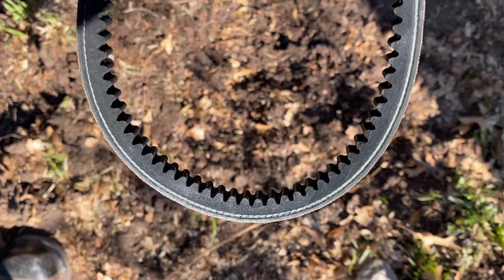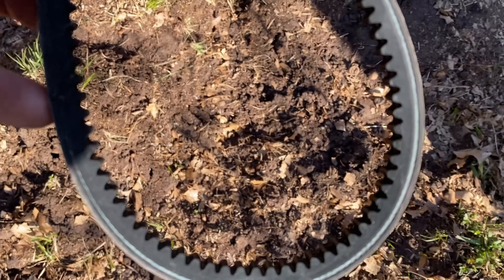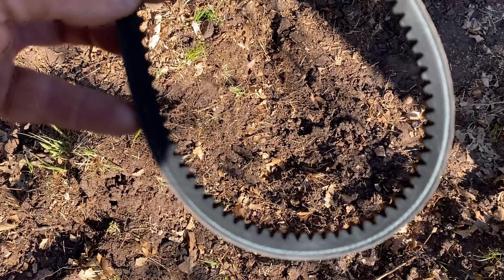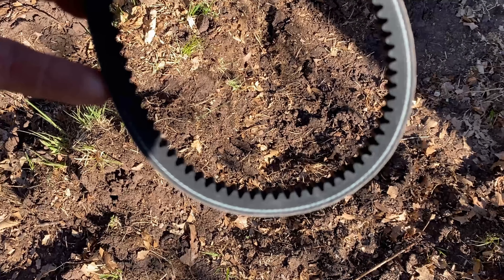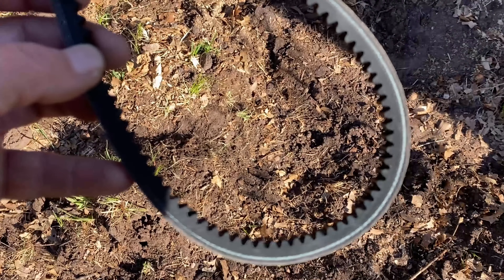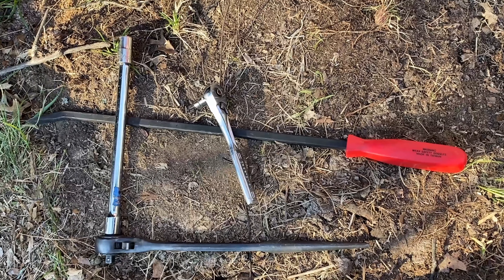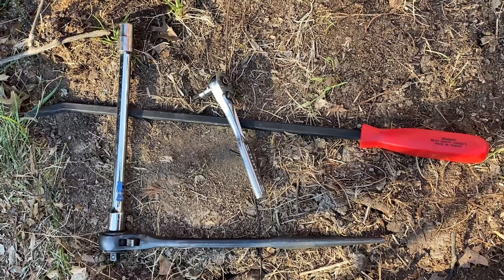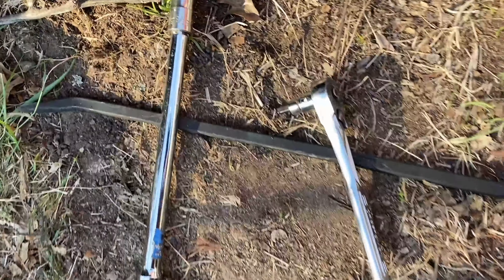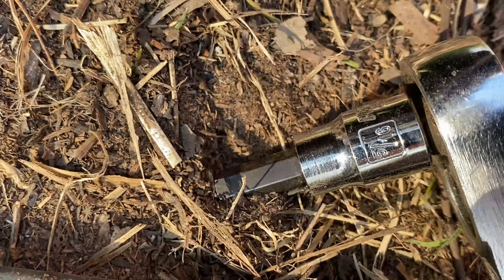This is a Bobcat belt, good for this 863G series. They needed to know it was a two-speed machine to get the right belt — they believe this is the one with the lug traction on it. I picked up both belts just in case, because there are two possible options and they're an inch different each, and I just have no luck getting the right one the first time. I'll just return the one I don't use. Tools I use for this job: a long pry bar, a socket with a long extension and a 9/16 socket, and a small socket wrench with a 5/16 allen wrench.